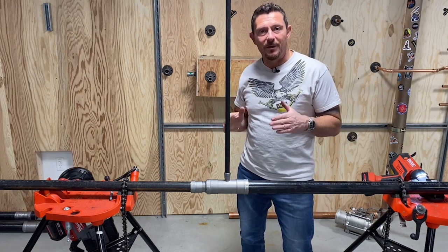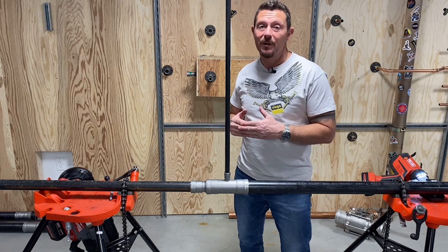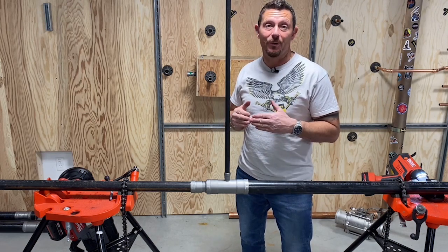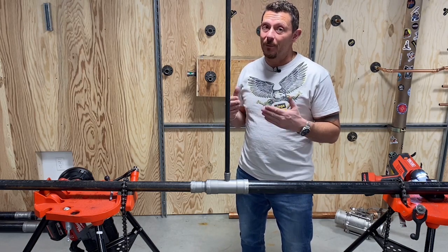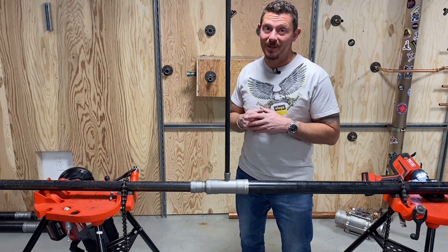And that is just as straight and pretty as can be. If you understand which way the fitting is moving, you'll also understand which way the pipe is going to move. It's easy to control deflection — just remember, it always moves towards the opening of the ring or the jaw. That's it.